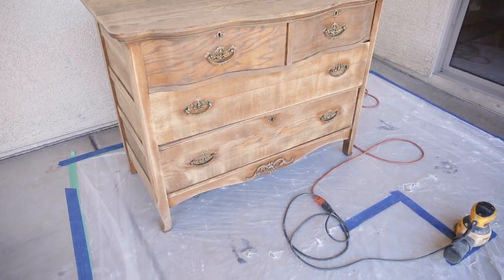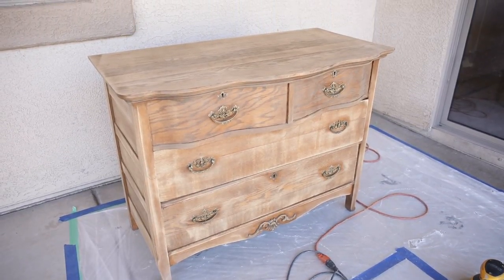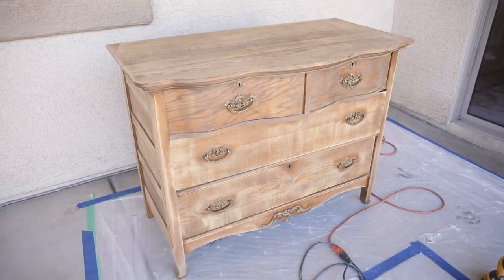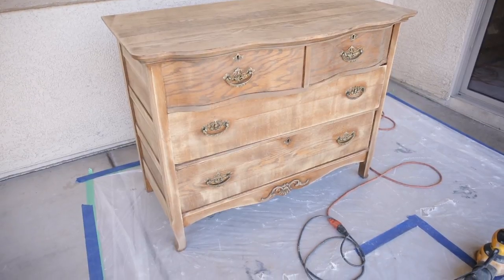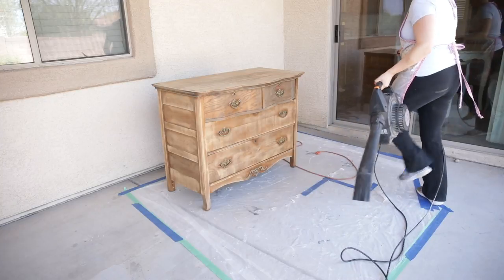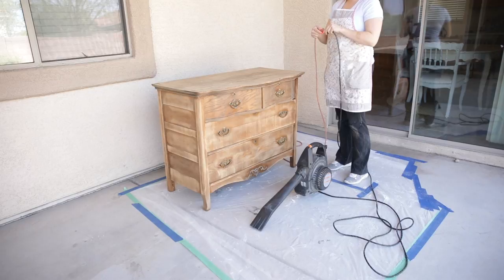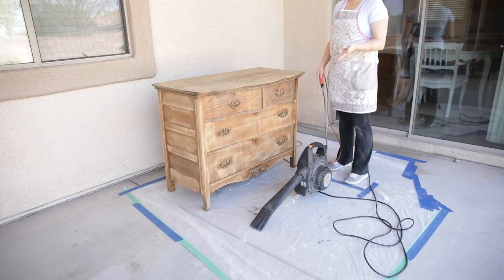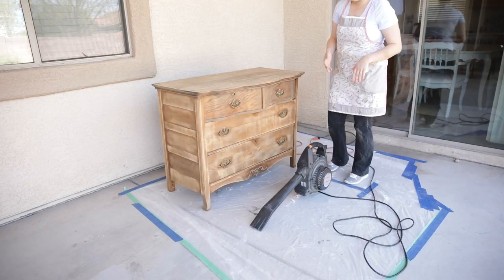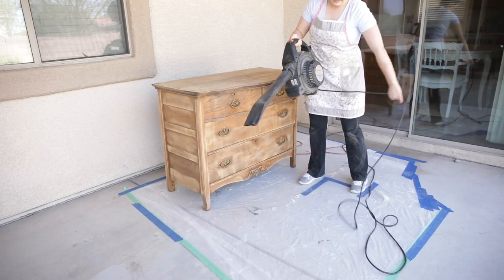At this point I'm completely done with all of the sanding, and I'm going to blast all of the dust off using my leaf blower. You can also just vacuum it, dust it off, or wipe it off. I'm going to blow it all off and then wipe it with a damp cloth and let it sit and dry for a few minutes. My leaf blower is actually a two-in-one tool — it's my shop vac and I can just take the top off and use it as a blower, which is amazing. If you need a shop vac, maybe find one that is a dual tool — I'll try and link this in the description. I really love mine.